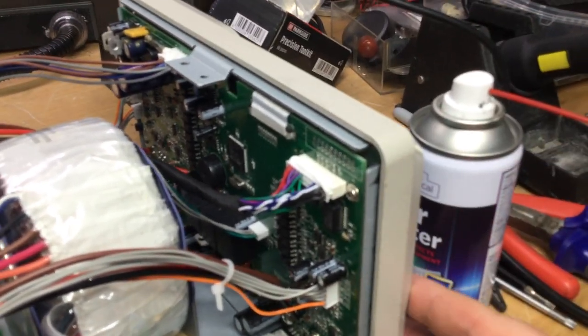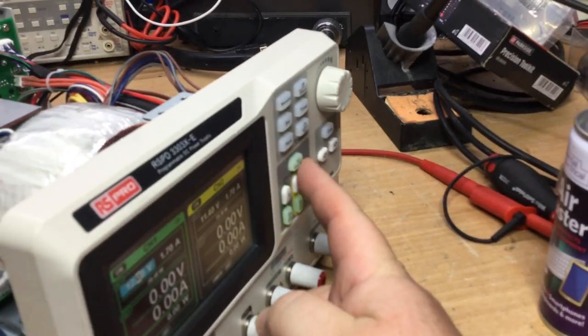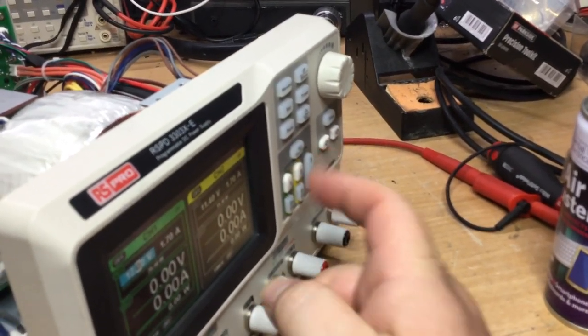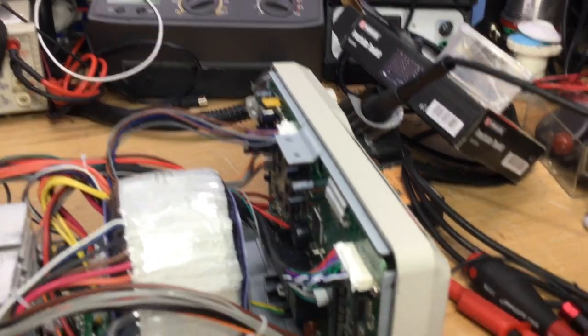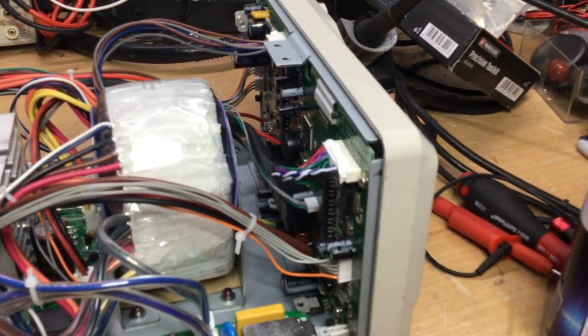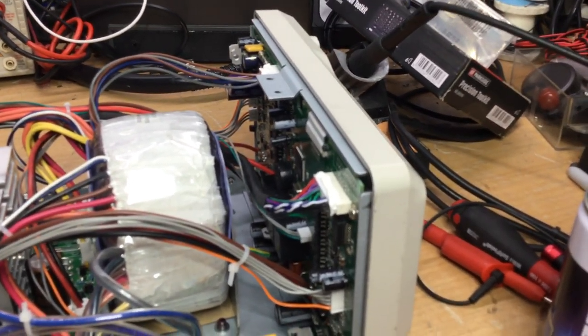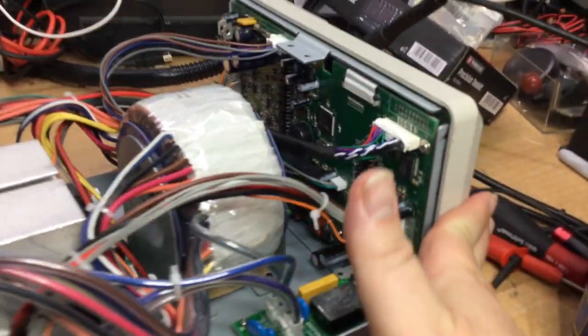You might not be able to detect it on the camera, but I can hear it when I hit that button there and the relays come on. So it's as if it causes a load somewhere and then maybe reduces a voltage, perhaps, when the relays are energised, and thus perhaps the oscillator is struggling to run, which is what we were looking at earlier.